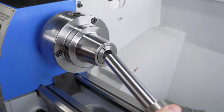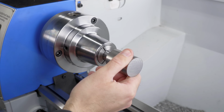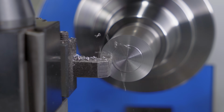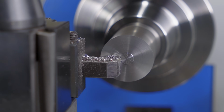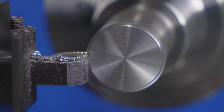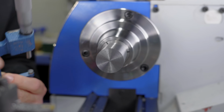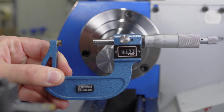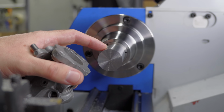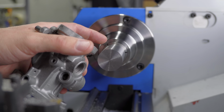I'm looking for the right way to fix this, and it begins with machining the flanges square to the bore. And I guess it's about time I explain what I'm doing. I'm making a tool to hold the carburetor body from the bore. I think you can call this an expansion arbor, or a mandrel.